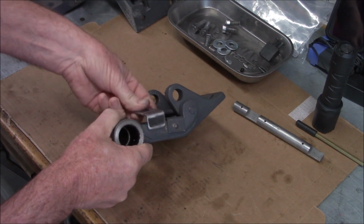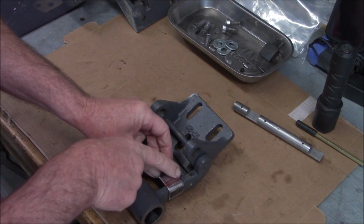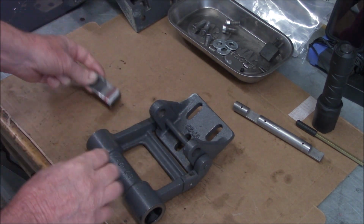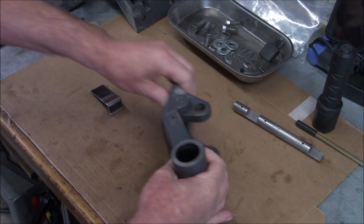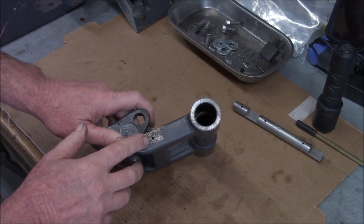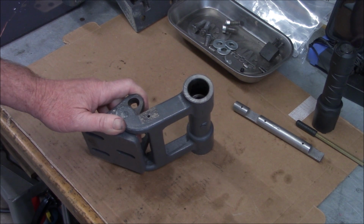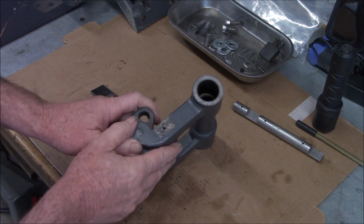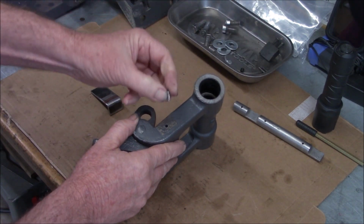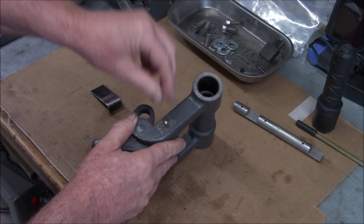So we've already made our bend. We got that length figured out, and you can see I got a scribe line here. I'm just going to cut that off, and that'll be ready to go. We got to drill the mounting hole. So over on this side, I was able to unscrew about half of that drive screw, and then the other half broke off. So I got in there with a 1/16 carbide end mill, got it drilled out, and found another, a stainless steel drive screw. So we're good to go there.